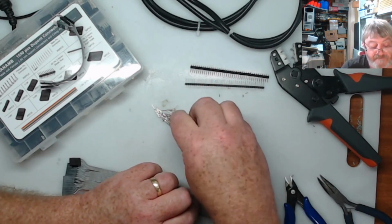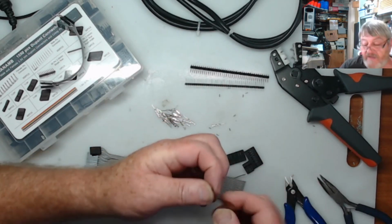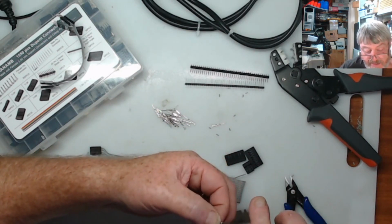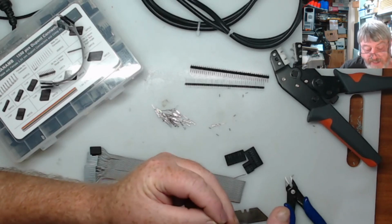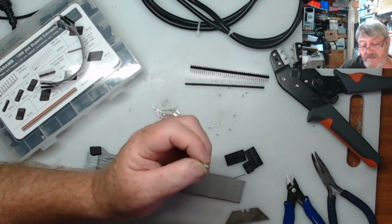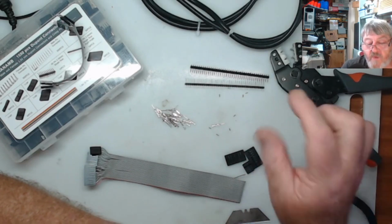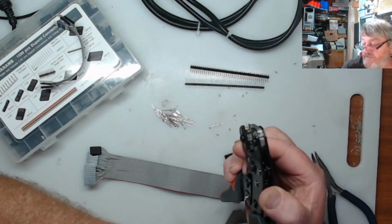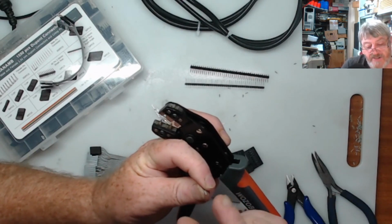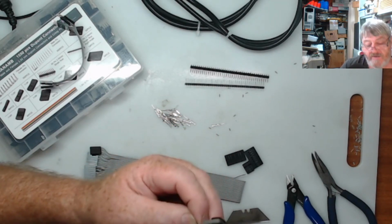And these male Duponts are pretty much the same as the female. The other thing you may see me do, and ask why, is where the crimp goes around the plastic, I give them a little tweak to square them up straight, because 9 times out of 10, when they're made out of the factory, they're splayed out slightly wider than what will fit into the jaws of the crimp, and I find it's really hard to get them in there. So if I give them a gentle nudge in and line them up square a little bit more, I can slide them in there a lot easier and lock them in.